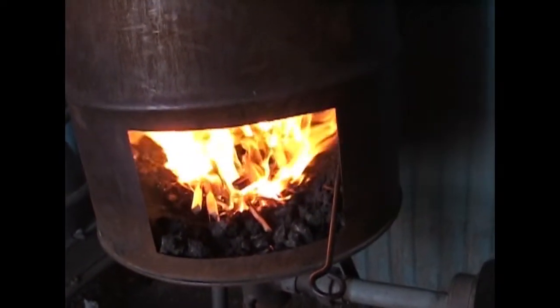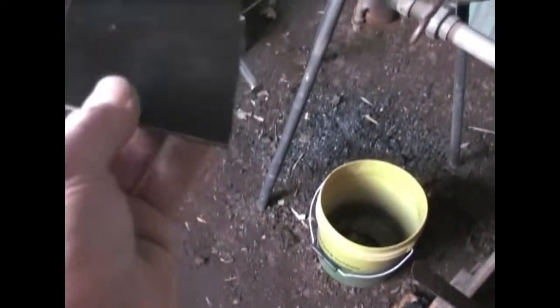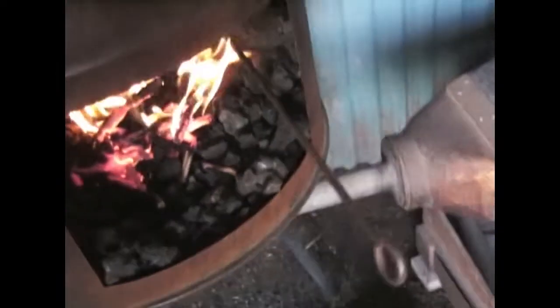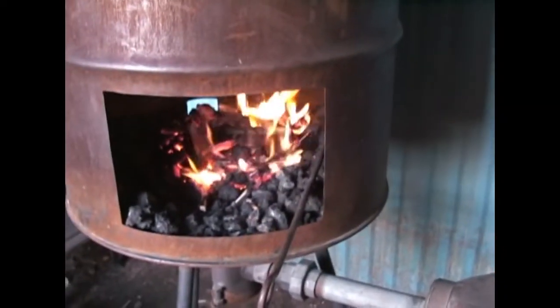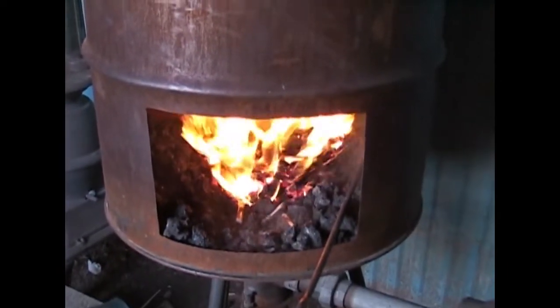Yeah, that's getting hot — I'm gonna have a fire going here. I made this piece to cover up the hole in the back there, and when I'm not forging swords I'll just put this on the inside to cover up that hole so my coals won't fall out the back. I've got a dirt floor in the blacksmith shop. Now I'm getting a good bed of coals; the flames will die down and I'll start using water to concentrate my heat in the center, and pretty soon she'll be ready to put a piece of metal in.